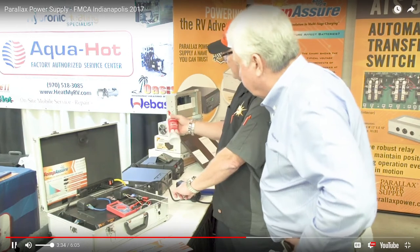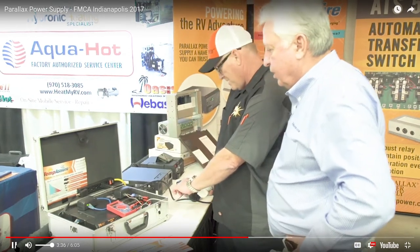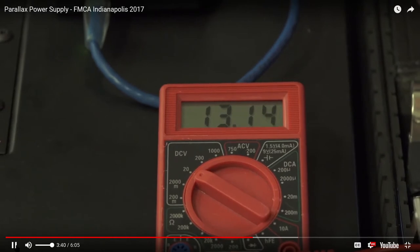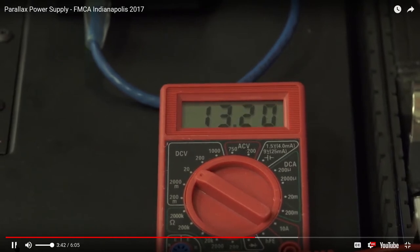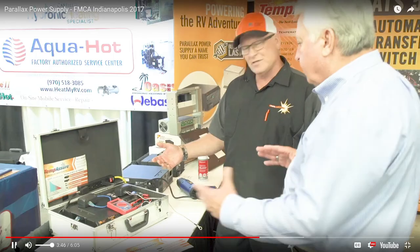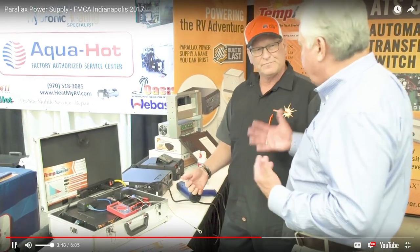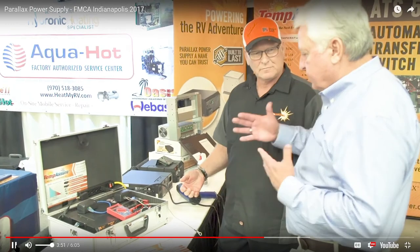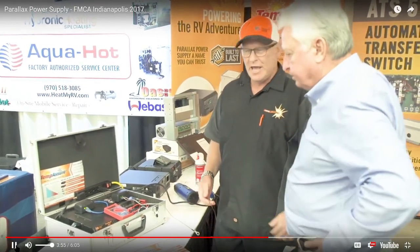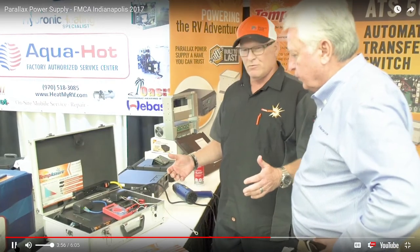Using some compressed air — just to simulate the cold. Now you'll see it going up. The voltage is going up! It communicates four times a second. The voltage pushes the charging amperage to the battery bank. If it's not compensated, you run the risk of boiling the electrolyte.